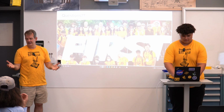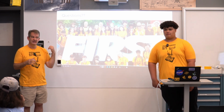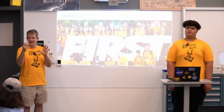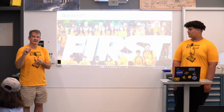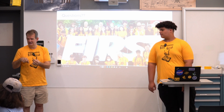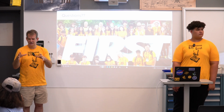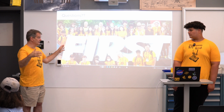So we have offline testing, so we log data and we can play it back, making sure things are giving us the right information. We have a lot of visualization tools. You saw some of the visualization where it's showing where the robot thinks it is in the world. There are some basic unit tests that just say, hey, I got a tag measurement, is it placed in the right place? But those are pretty basic. A lot of it is just observing where the robot thinks it is relative to a map of the field.